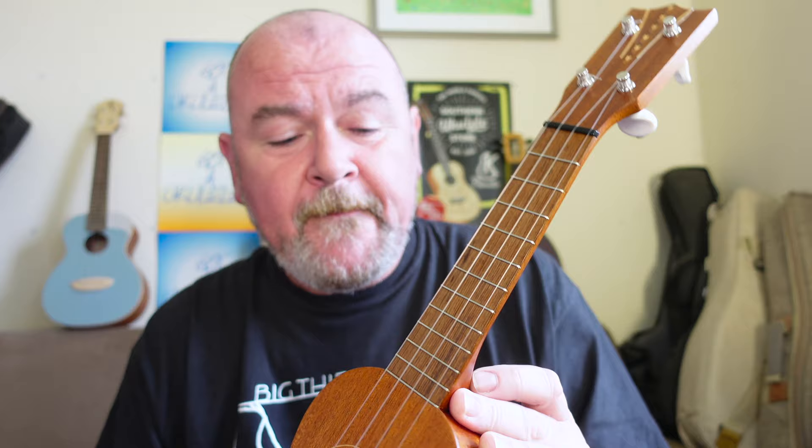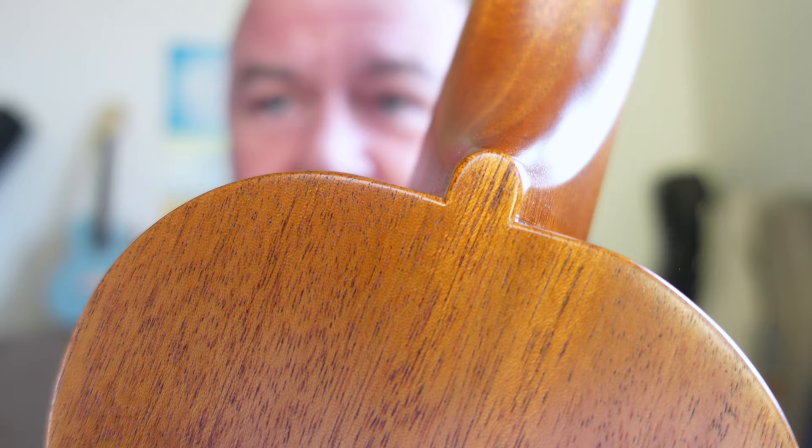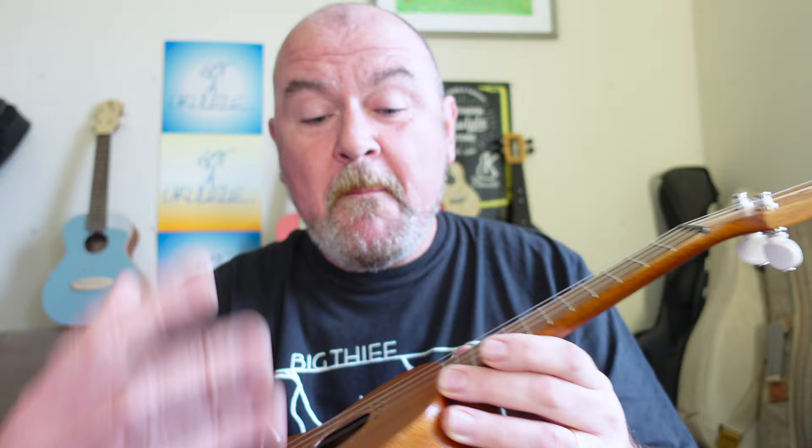The linings are not notched, as was the case with the originals. But this is a really interesting build — it's almost like a Spanish heel thing. The neck has a block on the end of it, and then the body is built around the edge of the neck. So actually the back is the last thing to go on. He basically builds the slots, slots the sides in, then puts the top on, then puts the back on. And as you can see, the cap on the heel is actually part of the back, because this covers the dovetail — well, it's not really a dovetail, it's more of a Spanish heel, built around it. Great for stability, no bolt in there, great for keeping the weight down, very, very secure way of building it.